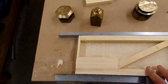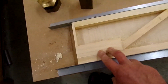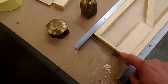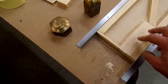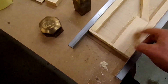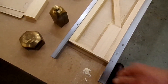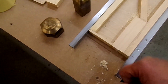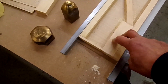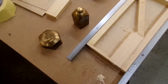So this spar is just about ready for me to put the little plates — the gussets — on. Before I do that, I'll wire brush with a fine stainless steel brush to make sure the grain is clear of sanding dust, then blow the whole thing off with compressed air. I'll do that a couple of times to make sure the grain isn't clogged with sawdust.